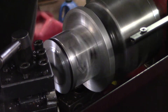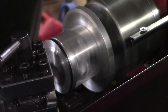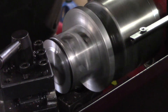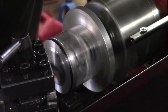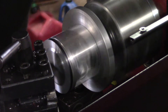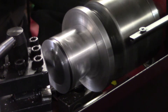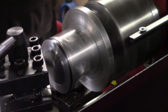She's cutting pretty damn good. Shake this out — just getting that off. You can see that pop-up almost. Looks like we're at about 40 thou. Now 30 — so 20 thou off here, that means I got 20 to go. I'm going to try to sneak up on it. Let's do another 10. I took 25 thou off this piston total.